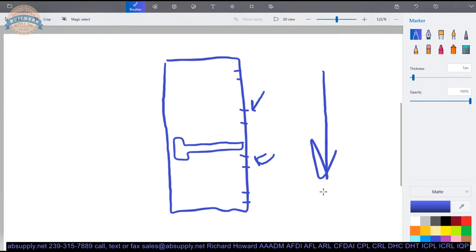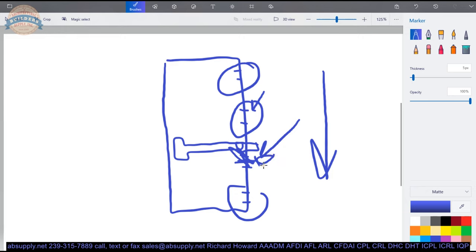Two things are in play here. The CDL from Command Access will let you put it right where you want it — no worries about how you're going to drill this. Number two: when you are not using electric hinges, you are not sacrificing the load bearing capability of a standard hinge, because you are not trading it in for an electric transfer hinge. This client's doors are two and nine sixteenths thick — about 268 pounds. So we're going with five inch tall heavy weights. We're losing the capacity of one of them because of an electric transfer hinge. The CDL is a cheap solution that doesn't force you to give any yardage.